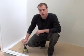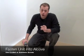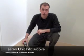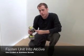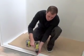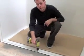Now that you've gone ahead and pre-drilled your holes, your next step is to fasten the shower into the alcove. You're going to want to use coated or stainless steel screws to prevent corrosion. Start in the center on the lower nailing flange or the angle bracket and move your way out following the pre-drilled holes.